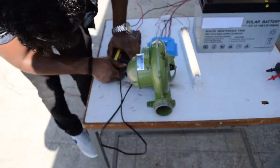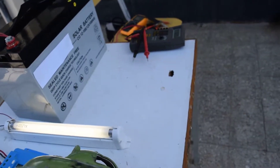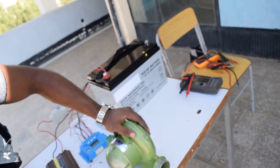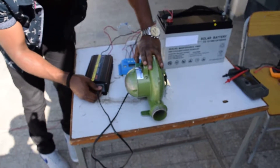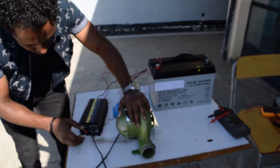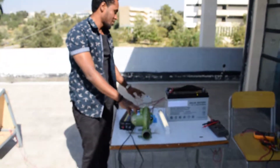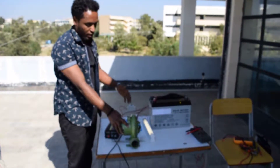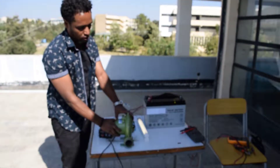There is something on the fan — let us be careful with it. We just need to turn the breaker on first, then turn the inverter on. Because we have a protection system, we can't turn the inverter on without the breaker. If there is a current that could damage the inverter, this protects it. That's why we pass through the breaker.